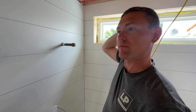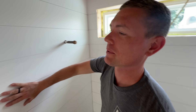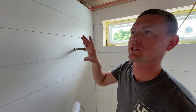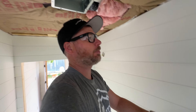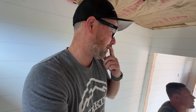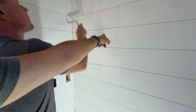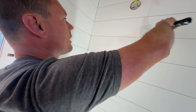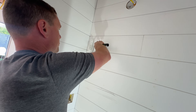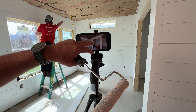I can get the paint blobbed off my roller in between the cracks pretty easy. There's a tiny bit of texture in this wood — it's pretty smooth and sanded, but I think the roller texture is going to help. The sheen is going to be nice with a little bit of roller texture. I went with a paint color that was almost the exact same color as the primer — I think it looks really good. White keeps the space nice and bright. We're not having to paint in the grooves, which seems maddening since we're using such a similar paint color. You could pre-paint it or paint with a brush meticulously — or spray it — but I think this is going to work fantastically. Let's check out this time-lapse of us painting white paint on white primer.